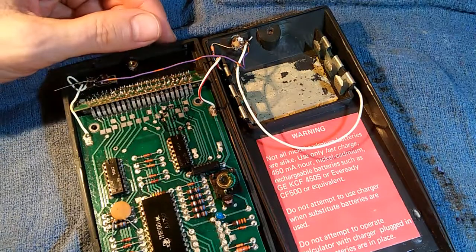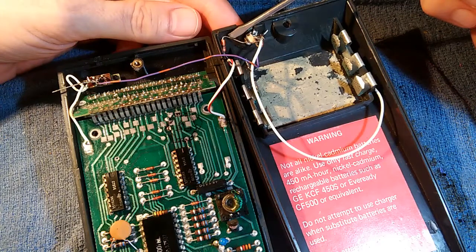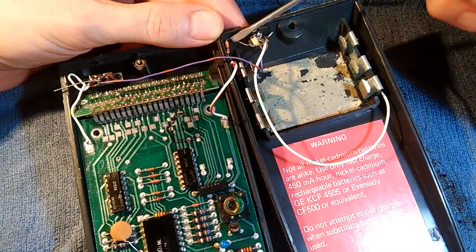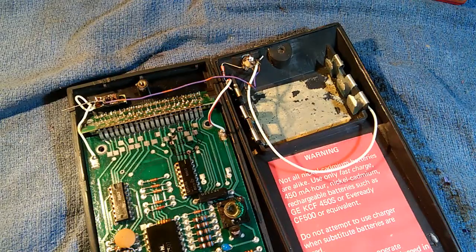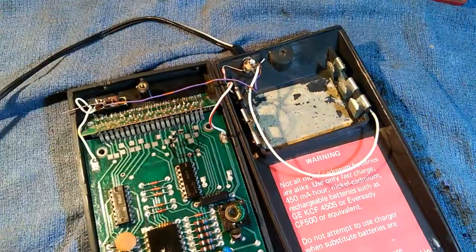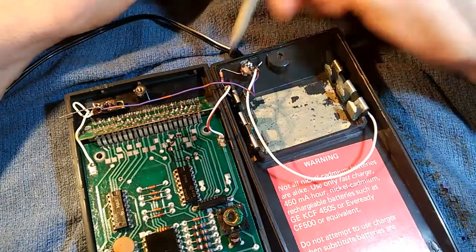So how do we get our DC voltage? We have just a simple single diode — basically a half-wave rectifier. It's AC on one side and rectified on the other side. I'm going to connect the power supply and look at this on our oscilloscope before the diode and then after the diode. This is the waveform before the diode — a simple sine wave. And after the diode: the sine wave with the lower half chopped off.